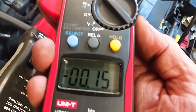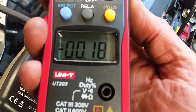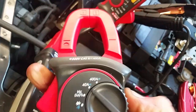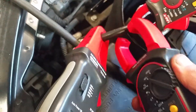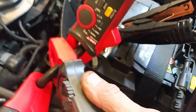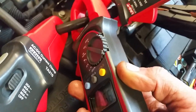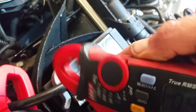With these wee ones you have to make sure you get one that does DC. A clamp can't really read DC directly — what it's actually doing is there's a wee coil in there, it's a CT — a current transformer — and what it's doing is picking up the magnetic flux of the current going through the conductor, in this case the negative battery cable. It's actually reading voltage, but there's a microprocessor that's converting that to current.